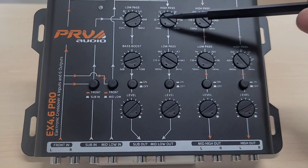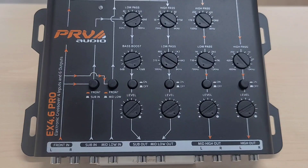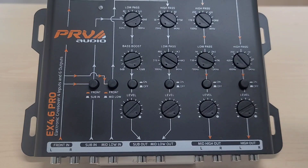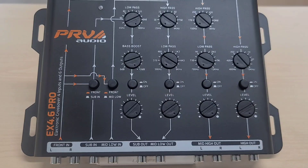The mid-low out has both high-pass and low-pass filters, making it quite versatile. However, it's not recommended for tweeters or titanium compression drivers, since you'd be losing high frequencies on the low-pass filter — titanium compression drivers can play much higher than 9,000 Hz. The high-pass filter starts at 25 Hz and goes all the way up to 4,000 Hz, making it well-suited for phenolic compression drivers, mid-range, or mid-bass. The low-pass filter cuts from 300 Hz up to 9,000 Hz, plus there's an on/off switch and level control.